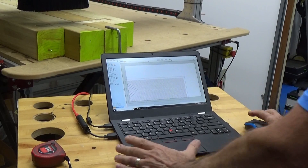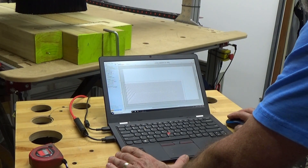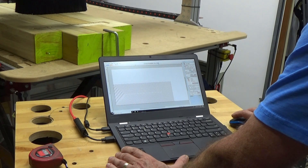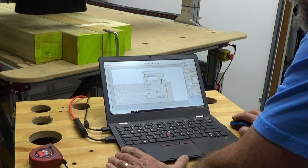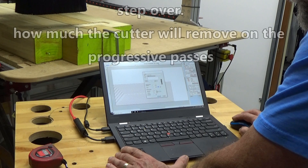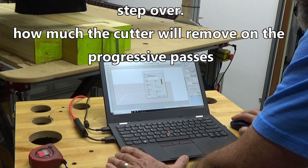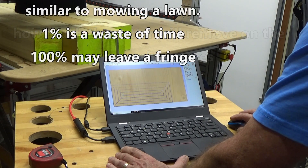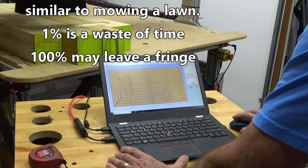This is what I'm doing — I don't want it to take that long. So I'm going to increase the step over on the toolpath. The tool — we're going to edit step over. We're going to take that up to 80%. Close that, check the time on it, and that's brought it down to 15 minutes instead of 2 hours.